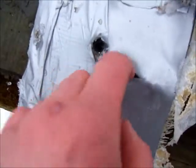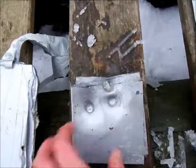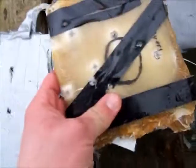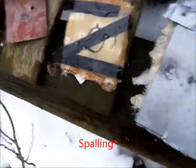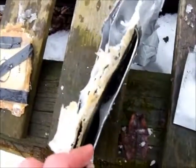You can even see the bullet barely in there. I'm not going to use this design. I might go three or four layers of this steel back to back, tack-welded together with rosette welds, then put about ten layers of fiberglass woven roving over it to keep spalling from hitting me. This composite is good for one shot and superior to plain steel, but for multiple shots I would not trust it.